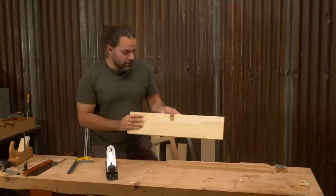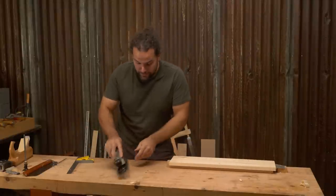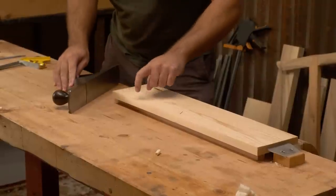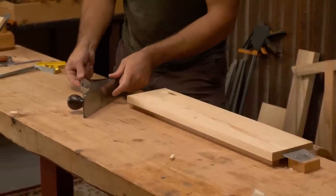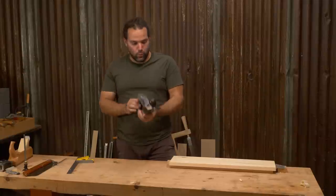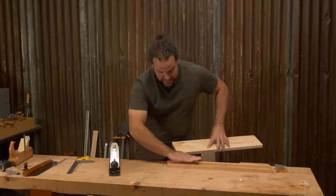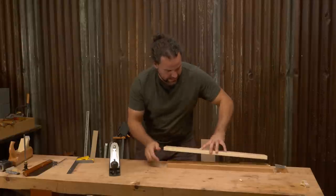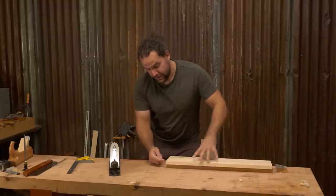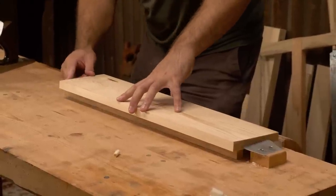Now with this method, because the board is fixed and rigid and the plane is fixed and rigid to the bench, we can actually adjust that squareness if we need to with the lateral adjuster. If you're using a run-of-the-mill plane, that's square enough — they nearly always are. You can also adjust by making sure the supports are the same height. If one of these is high, you can see that naturally cants it up. It's another great thing if you've actually got to put some very precise angles in.